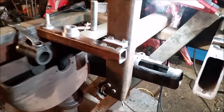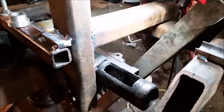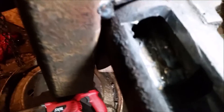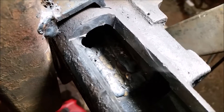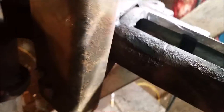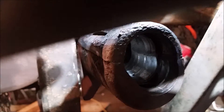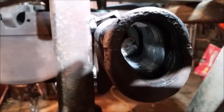With the bearings — this one actually had no bearings on the output shaft or the input shaft, it was riding right on the cast iron. What I'm doing right now is welding it up. I'm using 4340 Royal rod. I'm going to try to weld everything up and line bore it. If you look down here you can see the extensive damage — that hole is actually supposed to be round. Some places a quarter inch of damage. You can see the out-of-roundness. I'm going to weld that all up.